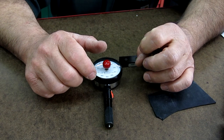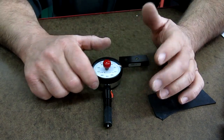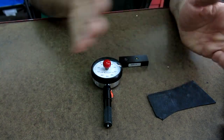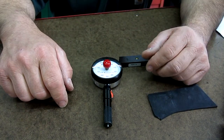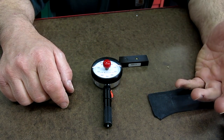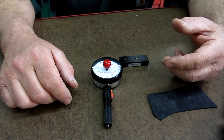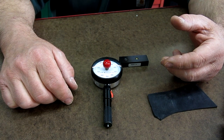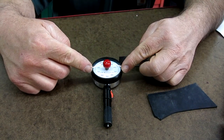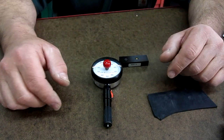But if you have to check rubbers and plastics and elastomers and stuff like that, you actually need a few of these. The Shore ranges overlap one another, so there's, I can't even remember now. I know there's about eight scales, and they all kind of overlap quite a bit. You can look up where. So if you're measuring on the O scale, you can see what it is on the D scale and all that. They have a little chart where you can look at that.